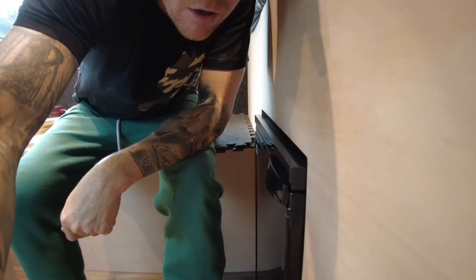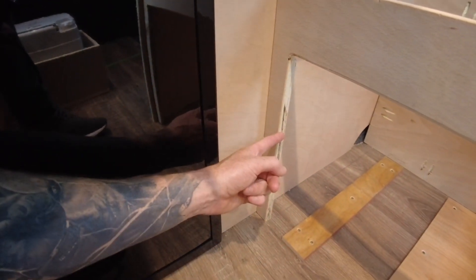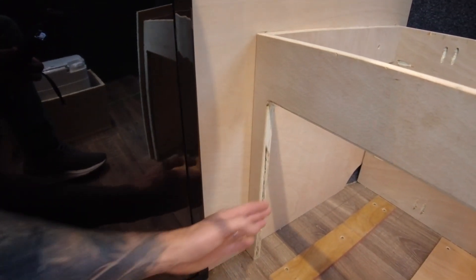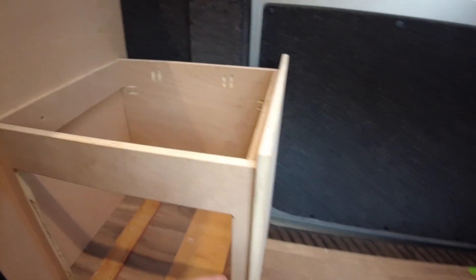This needs to have enough clearance for the fridge lip along here when it comes out. The issue we had is getting a runner in there, getting the drawer, and having enough room - we aren't moving all this out. So I'm using the drawer runners differently - I'm using them underneath the drawer. They're heavy duty and do take a lot of weight, but using them in this way I'm guessing that's not what the weight rating was designed for.